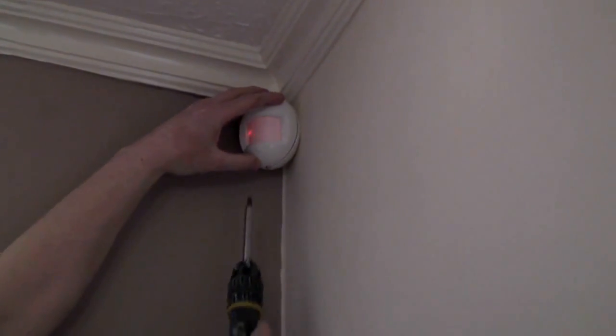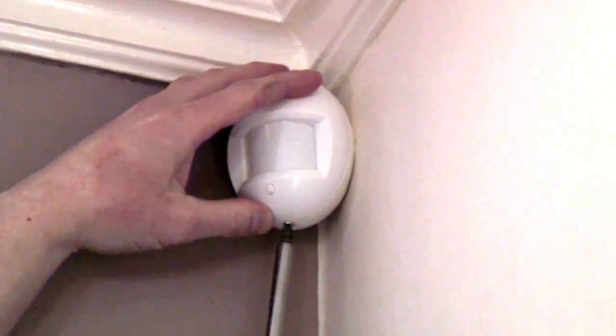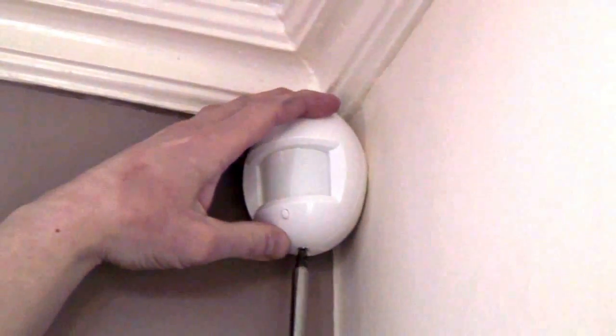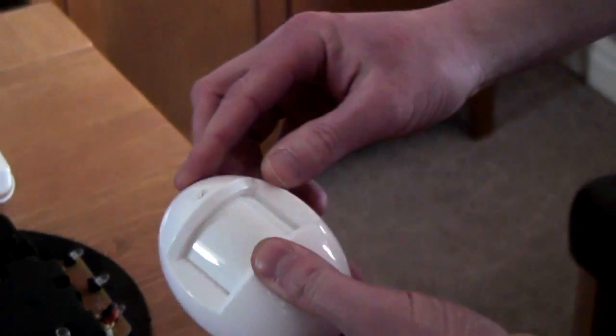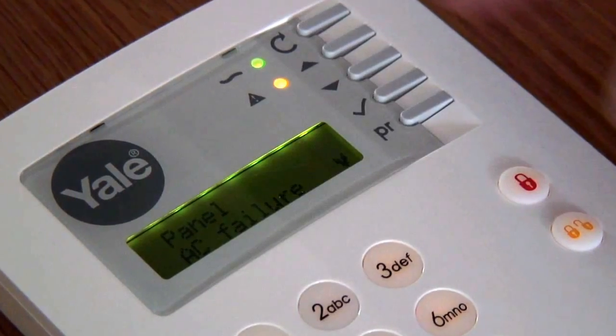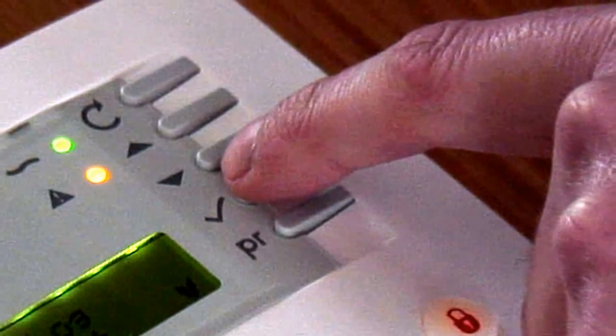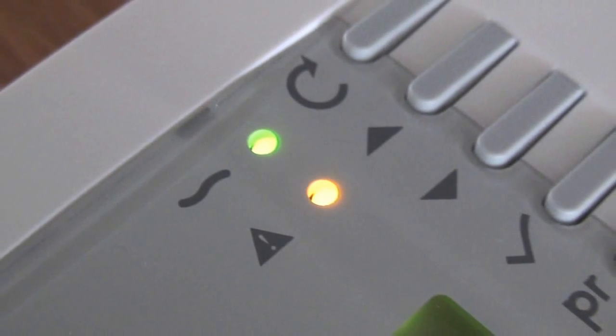If there is a tamper fault, check all devices are firmly screw mounted and the tamper spring is fully compressed inside the PIR and firmly compressed at the back of the door contact. The display screen will tell you which type of detector has the tamper fault and the particular zone number. If it is a PIR battery fault, all you need to do is replace the batteries or ensure that they are installed properly. The red light on the face of the PIR will flash on and off for 30 seconds after insertion of new batteries or reseating of the existing ones. If there is more than one fault in the list, scroll down and press the TICK key to confirm you have read them. When all faults have been rectified, the amber light will go off. If the amber light is still on, please repeat the previous procedures as there is still a fault present.